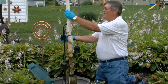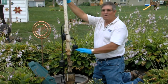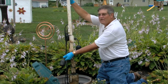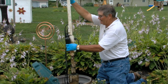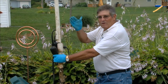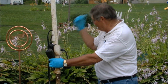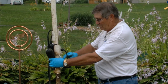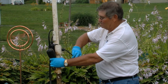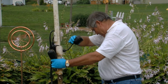So here's our high level check. You notice that turns on the high level alarm. The timer enable allows the timer to control the pump. So put it in the mode of controlling the pump. We'll go ahead and turn that up. What happens here is, as long as this is up and nothing else is up, the timer will operate as it's set and routinely pump to the treatment module when it's designed to. However, in an instance when we get high level, an override occurs, the timer override float comes up and it should turn on the pump, which it does. It's pumping right now.